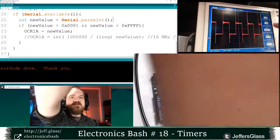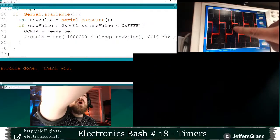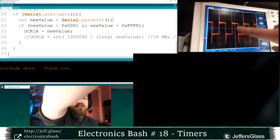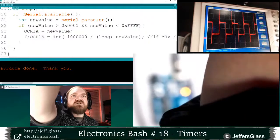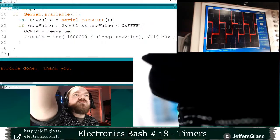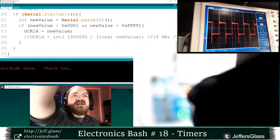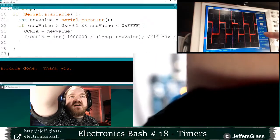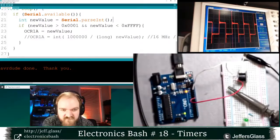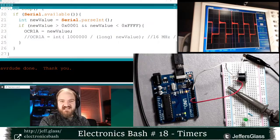And it's doing that. We can see up here the current frequency. It thinks the current frequency is about 2 kilohertz. It has a real hard time with the counting of this because you can see how dirty this waveform is, because it's going across this really capacitive buzzer. So what I'm actually going to do is use my cursors to measure the actual width of one of these waveforms. I think that's going to tell us a little bit more accurately. Delta. Yeah, I don't know if you can see it on here, but it says delta 82 hertz. That sounds more right. If you listen to this tone, that sounds more like 82 hertz than it does 2 kilohertz, I suspect.